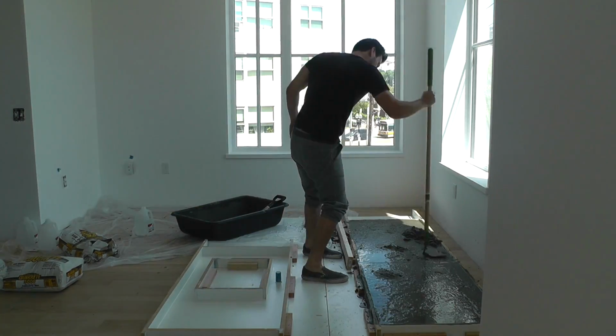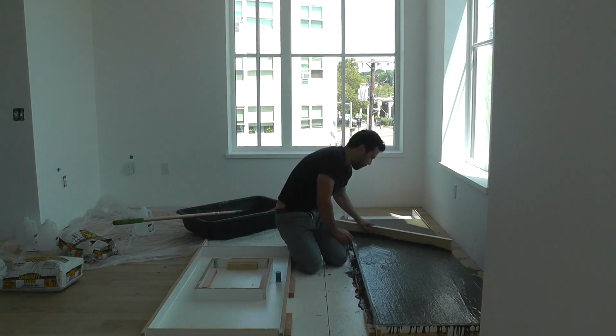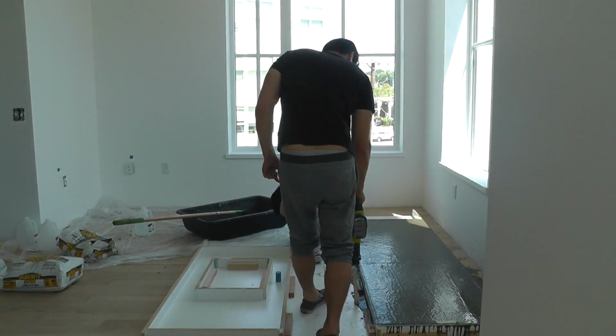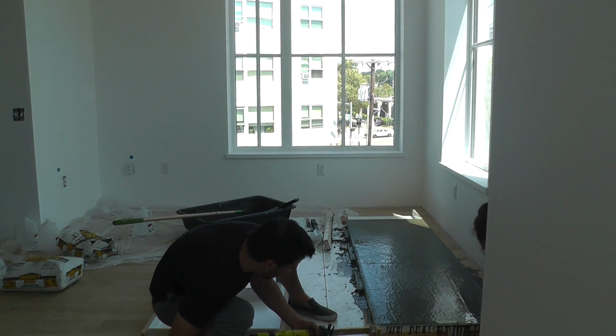I use the hoe to push the concrete into all the corners of the molds, and screeded the top of the concrete using an extra piece of 2x4. I hot glued a piece of wood to the blade of my reciprocating saw and used that to vibrate out the air bubbles of the wet concrete.